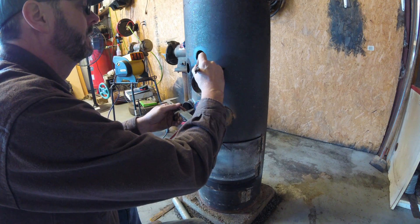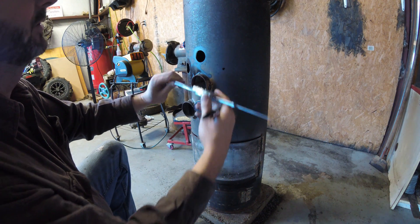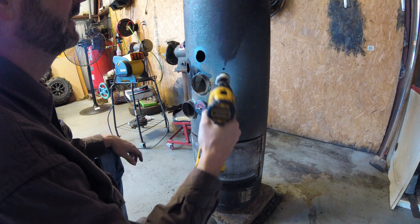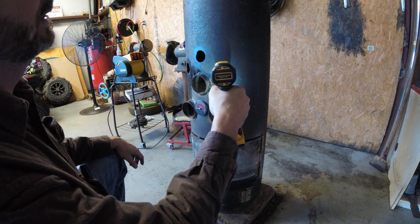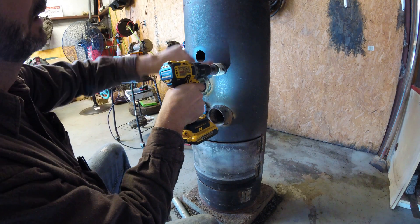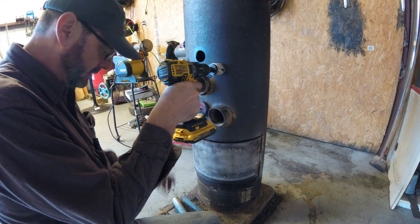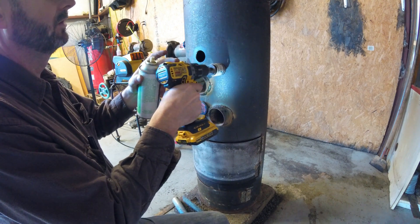The way I've done this, I've got a mark right here — that's the center of the tank — and I've got this set on three and a half inches. So go center to center, drill my hole. First thing I did is I extended my drill bit out a long ways, that way I could drill through the tank. I don't want the hole going this way or the pipe would have to go through the tank that way. So I'm going to angle my drill and cut the center section of the tank first, then cut the outer section as the hole saw goes through. I'm going to put my drill on low speed, give it a little cutting fluid.